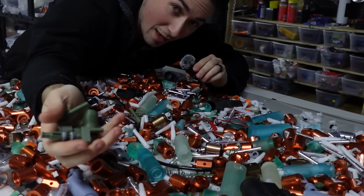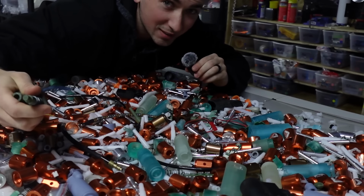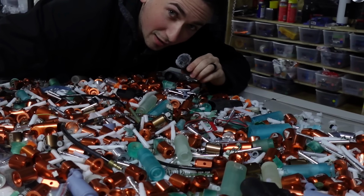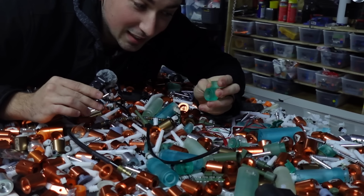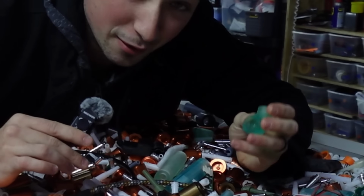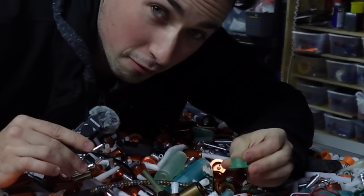I started prototyping with FDM printed parts, but they have thick layer lines, which meant it couldn't hold a constant air seal. This meant that it worked for prototyping the Kuba T1000 style engine, it wouldn't work for more complicated designs. To continue my testing, I ended up buying an SLA printer, which uses super small layer lines, but unfortunately, this didn't have the durability that I needed, and it also doesn't print overhangs very well.